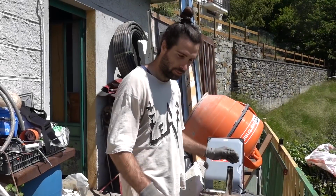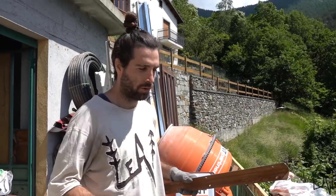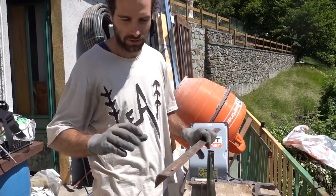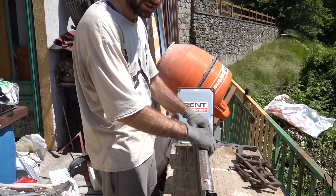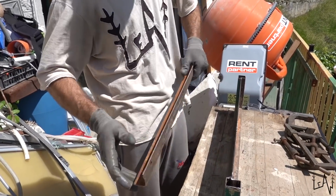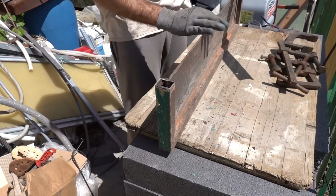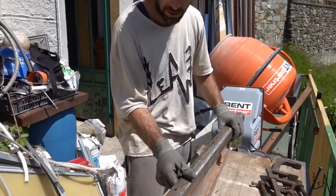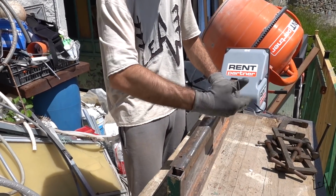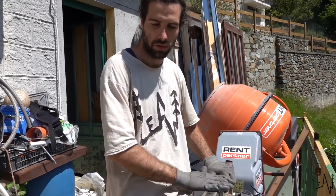Ciao. Beautiful people, this is the part we cut from the door down there. I don't throw away a lot of junk, and basically this piece of old steel was sitting there for years. It fits here, so I will clean it, take all the rust away, and I will weld it here, so it will reinforce. This part is really thin, it will reinforce it, and also the door will be closing all the time this way, so it's nice and round and smooth to close.